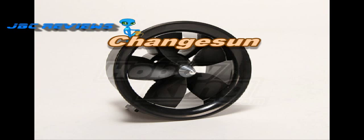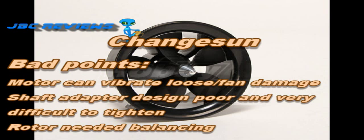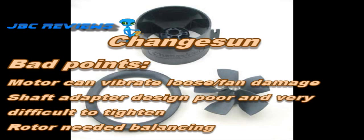Now the bad points I found in this, on the stator itself, the way the motor mounts inside, it can sort of vibrate loose and come loose and cause damage, and there have been reports of that. Also the way in which it mounts to your motor mount, the shaft adapter is not a very good system. It's very, very difficult to get it to tighten up nice and tight. Guys are using sandpaper washers and thread lock and stuff to get it to stick on, and to me that's not a good thing. You want that on nice and tight. It's the last thing you want is it coming loose or working its way loose.